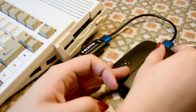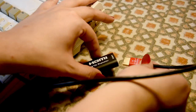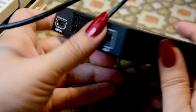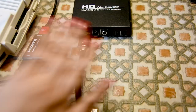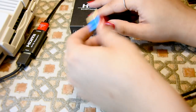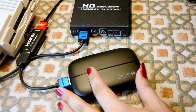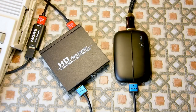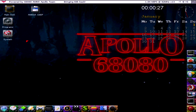I was trying to capture the video by connecting the HDMI to my capture device, the Elgato HD60. This didn't work at all. I remembered that Mikal from Distri.tv had contacted me about his setup because he couldn't capture from his Indivision AGA to his Elgato. The Elgato apparently doesn't support this type of signal. However, my Flylink upscaler has an HDMI input, so I tried that, and it showed up on my Elgato — relieved! I figured it must convert the signal. When booting up for the first time, it looked absolutely amazing. I was told it was Apollo OS, and it looks freaking cool.